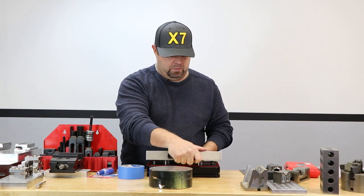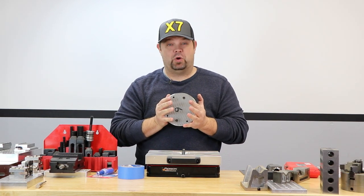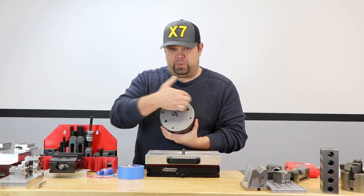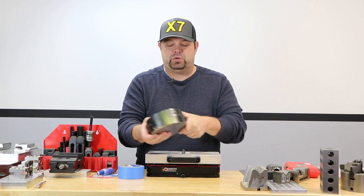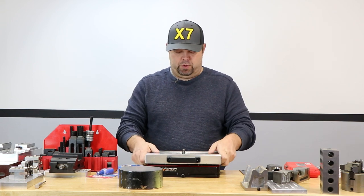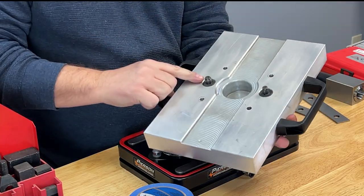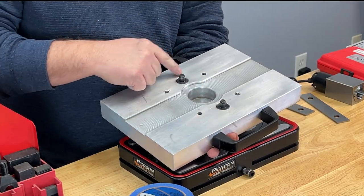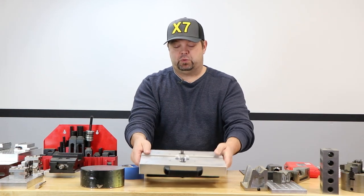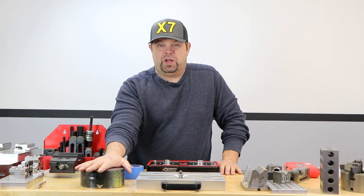We did side one of our mold cavities in a vise — good old fashioned vise. We machine them flat, drill them, thread mill them, put a big chamfer on them, and then they go onto a fixture like this where we bolt through the bottom. It has one round pin and one diamond pin — this is called a master locator and this is an angular locator. This repeats within a few ten thousandths of an inch, which is actually really good. This is a dedicated fixture to hold onto our mold cavities.